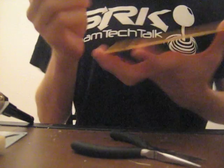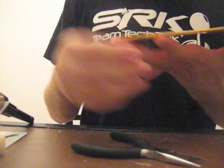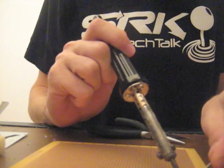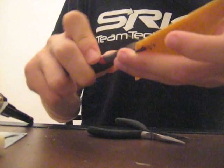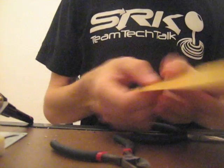This is really useful when assembling circuit boards that have a through-hole design. Here's just a regular old resistor — a pretty common thing — and using this process we can solder it to a circuit board using the perf board the same way we did with the wire. I'm just doing this to demonstrate that it's a very useful technique, and it's also much easier than surface mount soldering. After soldering components on, use a pair of diagonal nose pliers to trim the excess leads. You can try to pull them off, but the solder will hold — and that's a sign of a good job.